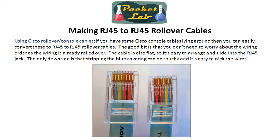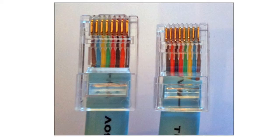If you have a ton of Cisco blue rollover cables, they usually have a DB9 connector on one side that connects to the console port on your PC, and on the other side they have an RJ45 connection that goes into the console port on your device. You can easily convert them — just lop off the DB9 part and pop on an RJ45 connector, which is exactly what I did here. The nice thing is you don't have to worry about splaying out the wires or getting the color right, because the flat cabling is already lined up perfectly. They don't have white-green or whatever — just solid colors. Lop off the DB9 end, cut back a little bit to expose the wires, then put on the RJ45 connector making sure you either flip the wiring or flip the connector so the colors come out on the opposite pin.